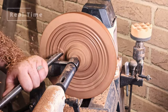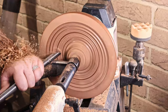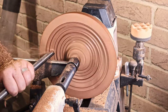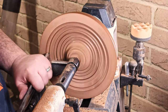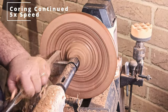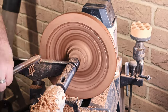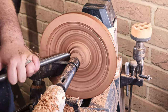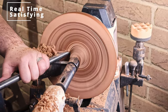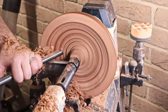This is a real-time clip of turning — I'm just poking the nose in, pressing from behind getting those nice long stringers to fly out. I'm just working it backwards ever so slightly and then I flip the tool around and do a push cut to get in a bit deeper. You may have heard that little vibration there — that's because I wasn't pressing down on the tool rest hard enough. A lot of the lathe work is listening to what it's telling you, because a lot of the time if you're not quite getting it right it will scream or make a specific noise that you can fix. When I originally started making pens I was wearing a headset because pens don't make so much noise, but bowls most definitely do.